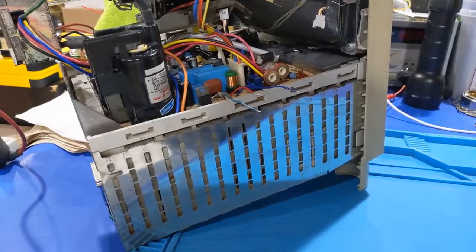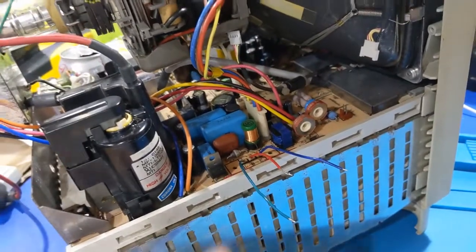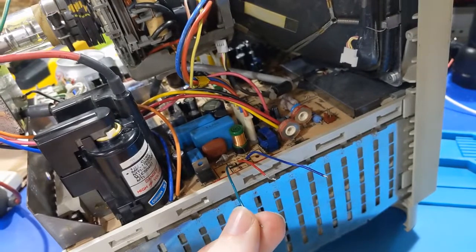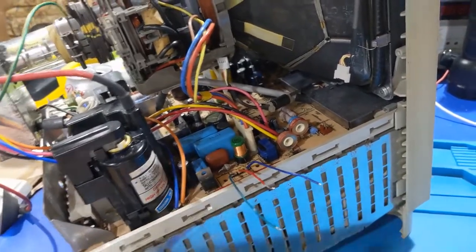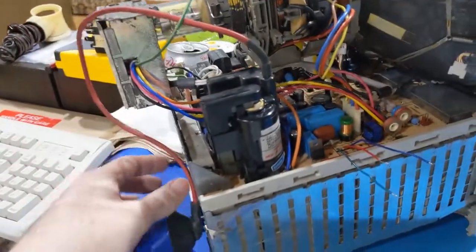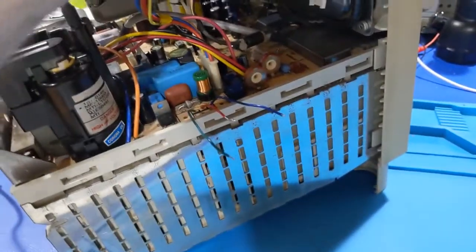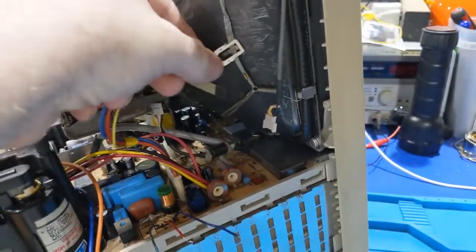That should do it, at least I think. I have these three wires here. One's ground, one's the power going through the flyback, and then this is the drive signal. So I put them where the horizontal output transistor was. I'm not going to worry about the anode lead and stuff right now because none of that matters. I'll clip that on so it doesn't short out with anything. But none of that matters right now, so I think we're good.